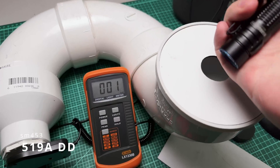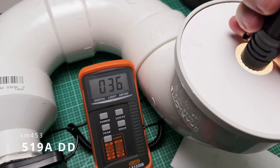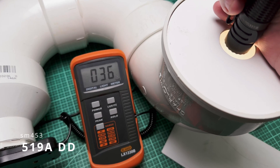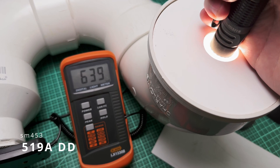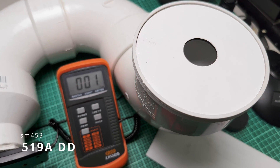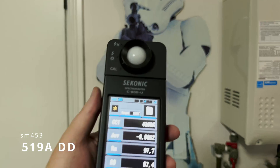We're back at the lumen tube with the de-domed emitter — same emitter but de-domed. Here's the half press: we're at 36 lumens instead of 40. We hit 750 on turbo with the dome; now we're at 630. So 630 divided by 750 is 84% — that means it dropped 16%. I said 15, so I pretty much nailed it.